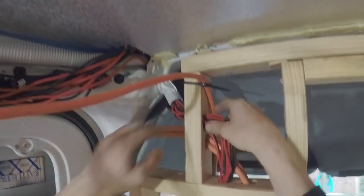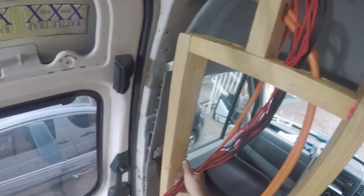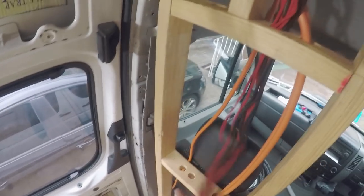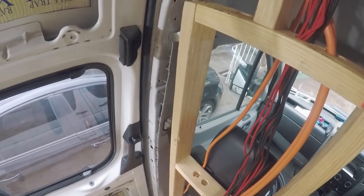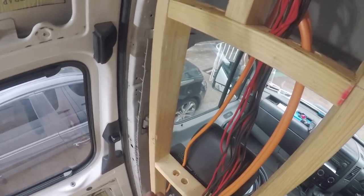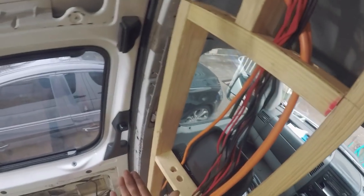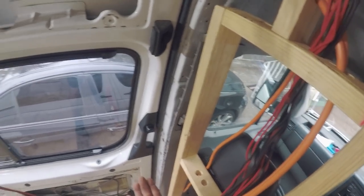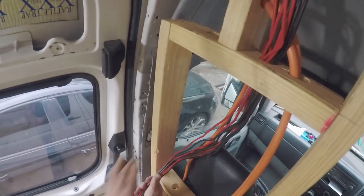They'll be in the bulkhead, and then they come down here in the wall cavity, and the switch position will be about there. So at this switch, it's controlling the 3x downlights, the 1x entry light, the shower light, the shower fan, and also the 2x back door lights. So there'll be 5 separate switches on the one plate just here.